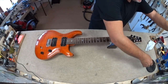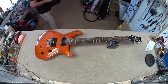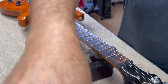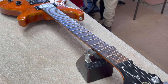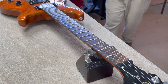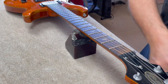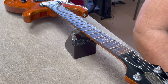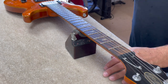So I'm up here today of an afternoon. It's a Thursday. And Met Office has slightly tricked me again because it tells me that what we've got is sort of below 70s into the 60s humidity here, but actually it's running just over 70 at the moment. So I've started doing some spraying in the other room because I have to get some polyurethane spraying done, and it's a bit more forgiving than nitro, but nonetheless I have to get it done. And tomorrow, when it must go down below 70, I have to get the nitro done.